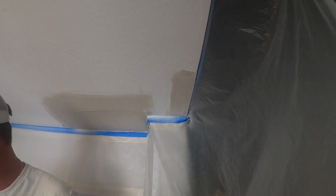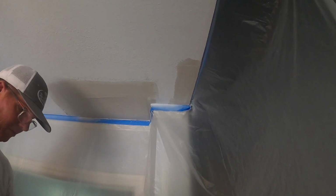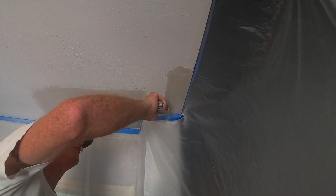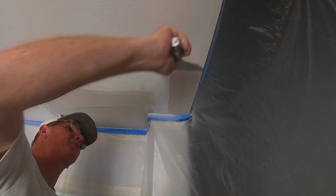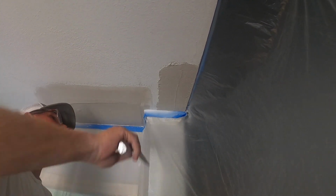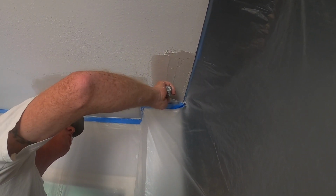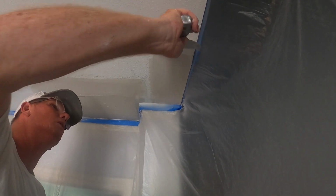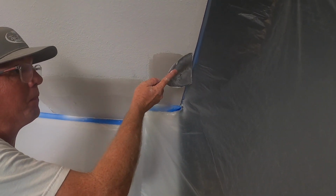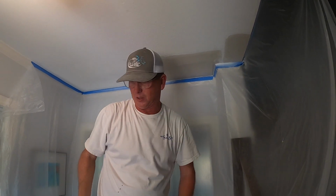And that fiber tape is beautiful. That's metal corner bead, so it tends to crack on a regular basis. But it will never crack again, I promise you. Just put a little bit of mud on here, and stay out of this patch. Feather edge. And there it is. So we'll let this set up, come back, and I'll see y'all in just a minute.